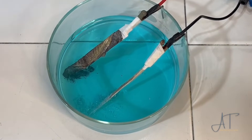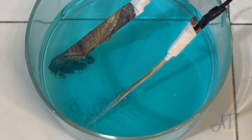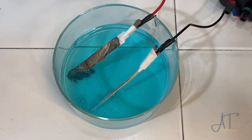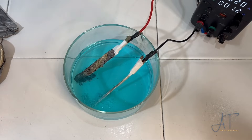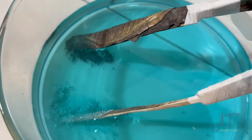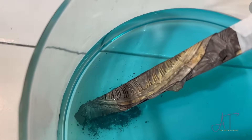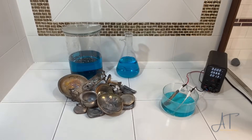After about 30 minutes of running you can see pure silver forming at the cathode and falling off, also working its way towards the anode. At the anode we're getting some debris falling off — that's just metal that didn't fully dissolve into the silver nitrate. That's the main reason we have the aspirator bottle in the see-through silver cell: to keep these two solids away from one another. The goal is to process one kilo of silver using only 500 milliliters of nitric acid instead of one liter. I'd say that's a successful test, so I'll filter the rest of the silver nitrate solution and run the main test.